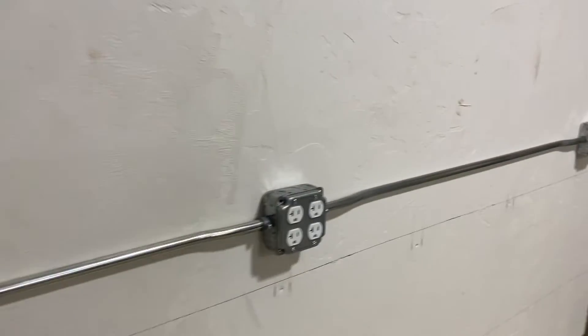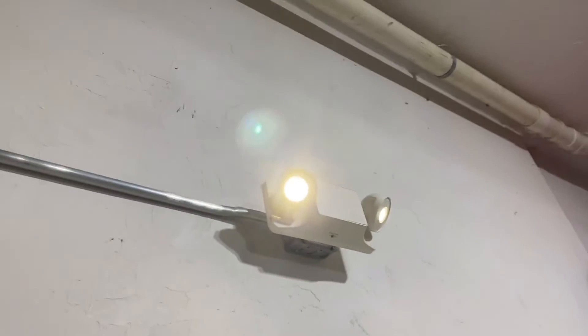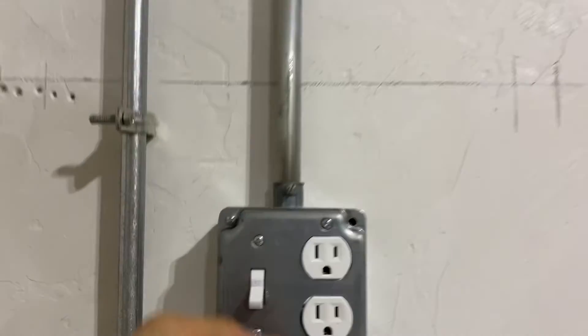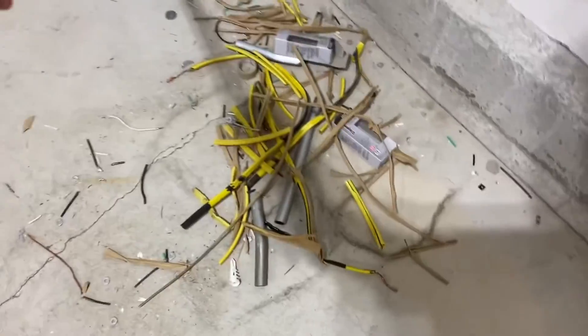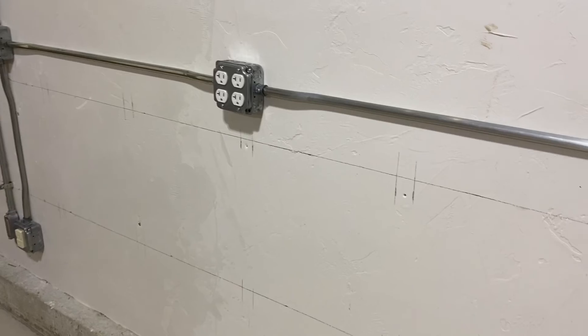Moment of truth — nothing blew up. The job is done, power is on. You can see I have all my outlets installed. Let's go ahead and test the GFCIs — properly wired. The emergency light is on which shows that it's working. Everything works as intended. This switch controls the emergency light and this switch is controlling this outlet which will eventually be used for lights. I did kind of make a mess — well, this is something you don't see often: someone cleaning up after their electrical work using a broom. I'm really happy with this and we can go ahead and start installing the rest of the benches now. Thank you for watching.